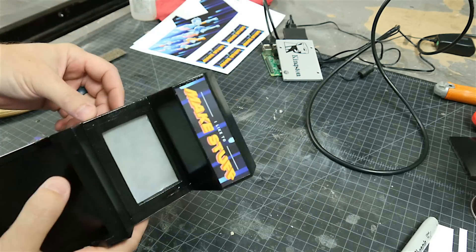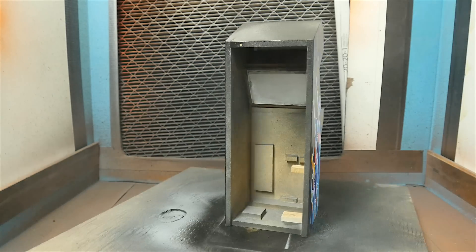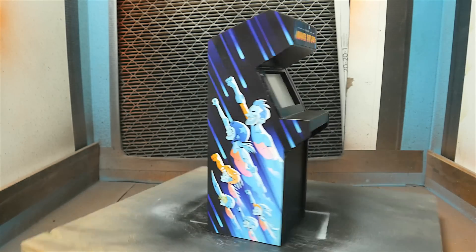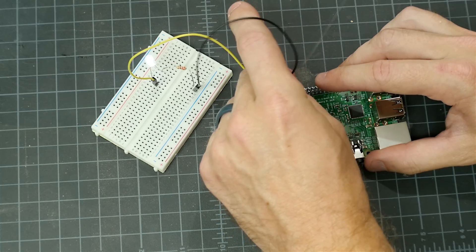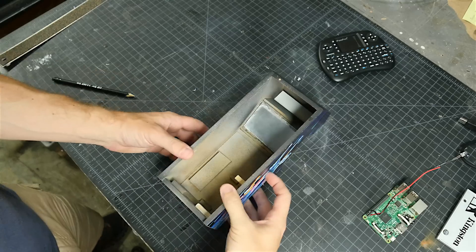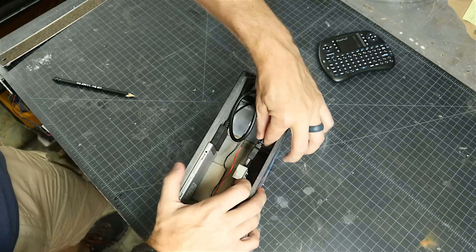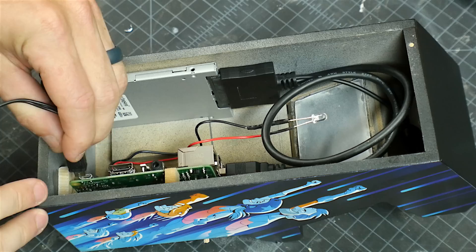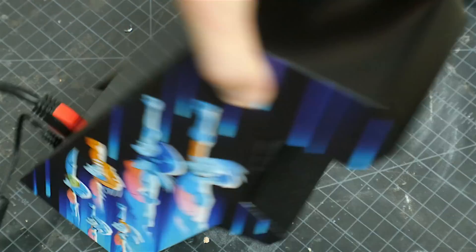I also cut down a marquee and stuck it on the front. The entire cabinet got covered with several coats of spray lacquer, and this helps protect the print and the paint. The last little thing to add is an LED and a resistor that just connect to the ground and the 5V on the Pi. This will go behind the screen on the little arcade machine so that we have a nice soft glow when the Pi is turned on. I slid all of the components in and hooked everything up. I had to adjust the USB wire a bit and the LED wire just to get everything placed correctly, but then I added HDMI and power and slid on the back panel.